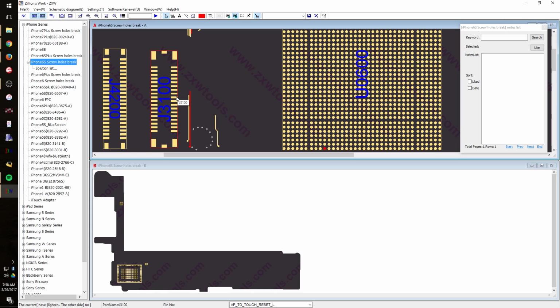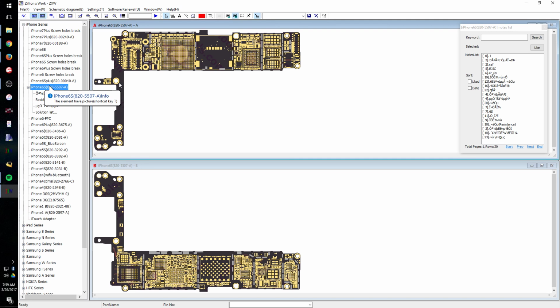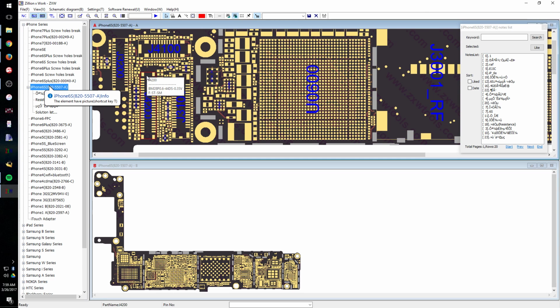Well, let's see. Let's go back to our list of candidates on PP1V8, which is like everything in the goddamn phone. There we go. All right. And I really don't think there's any chance my connector could have like a bridge under it.